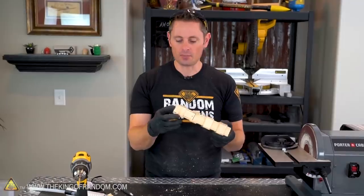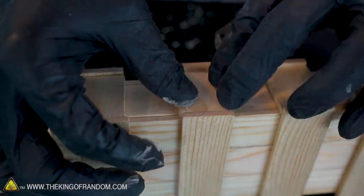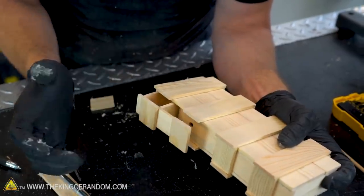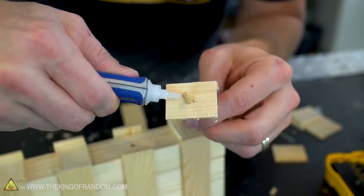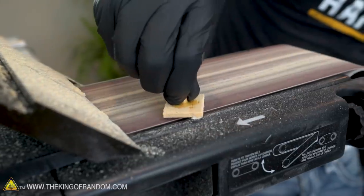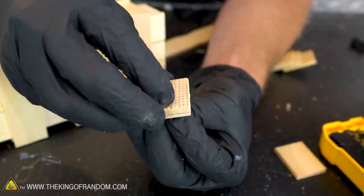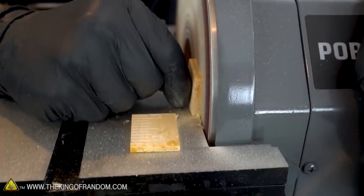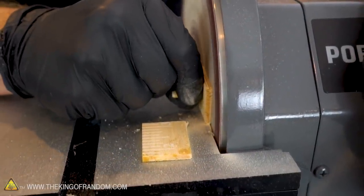With our dowel sanded flat and everything put back in place, we can go ahead and glue the panel on. We want to make sure we glue it to the side of the mystery compartment itself, so that when we undo the screw the whole compartment can fly out. We're going to do something similar with this secret side panel. We don't want it to be obvious that there's a dowel in the center, so we're going to put the dowel in, then grind this piece till it's half the thickness it was originally. Then we'll take another piece, glue it to the top, and grind that down halfway as well. That way it creates almost a veneer effect so you don't know there's anything hidden inside the panel at all.